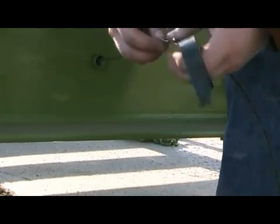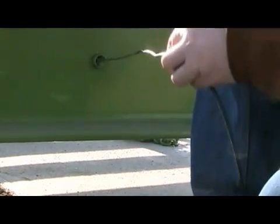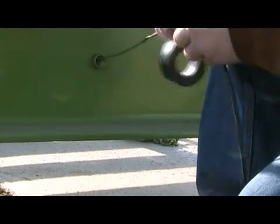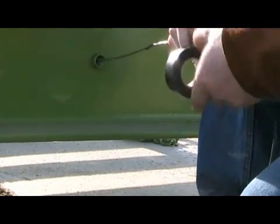Tape the end of the load cell wire to the fish tape. Have someone feed the line through while you pull it through at the junction box. Once the wire gets to the flex conduit fitting, screw it into the coupler.